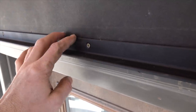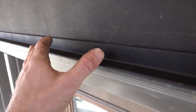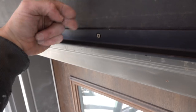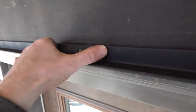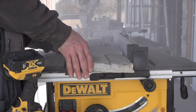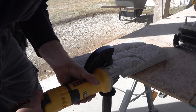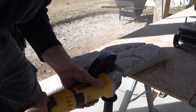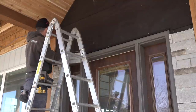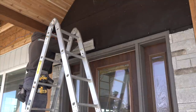This is 3/16 steel, and that works perfectly because when you cut that bottom tab off, the piece will want to swing in, so this gives it a nice stable place to sit. To make the right-angle cuts, I used a combination of the table saw and the miter saw, then ground off the remaining material with a diamond blade grinder. It worked out pretty well.